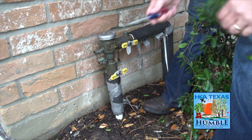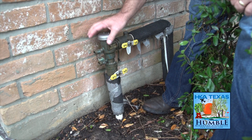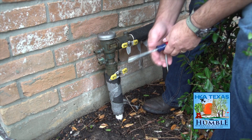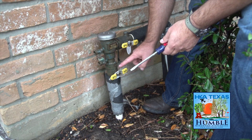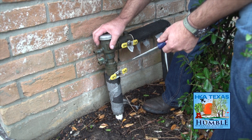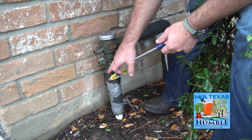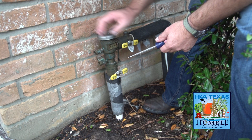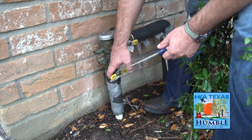The reason why that's important to know — this is not a fail-safe method. Because we have turned this valve off right here, we actually still have a column of water in this part of the backflow preventer, meaning it could possibly freeze and split right here on the side. The device may be good, but the actual shutoff valve might break.